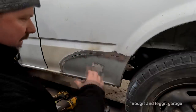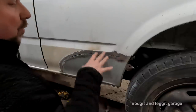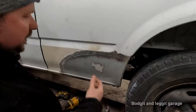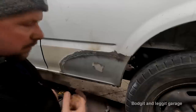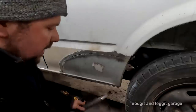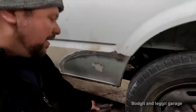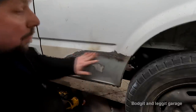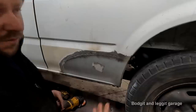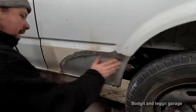But once you start getting into MIG brazing, it's another ball game, because your welder needs to be able to do it. That's another thing, and normally the really cheap welders won't. You need different gas. You need full argon gas, not a mix. And you need a slightly different core inside your MIG gun. Now, you can get away with using the ordinary stuff, but also what's very expensive is the wire. The wire is 3, 4, 5 times more expensive than normal MIG wire. So yeah, bear that in mind.